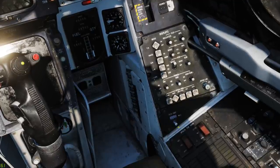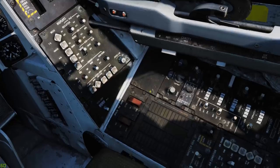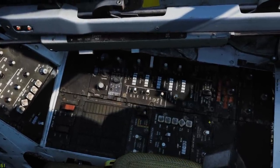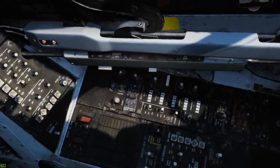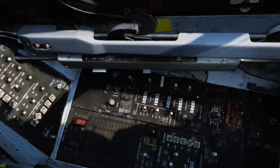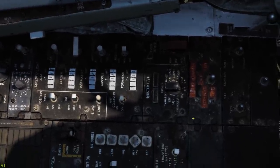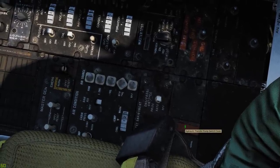Hiding just beneath that we've got our elevation for our gun. Coming down the right-hand console we've got our spoiler override — if we get any damage or lose some spoilers we can override the functions. Caution light panel — quite a big one, lots to go wrong. Generator panel, air panel for your air sources and internal air conditioning, external environments for anti-ice on engine and probe as well as the windshield. Down the outer wall: compass panel, ILS panel, lighting panel for internal, external and taxi lights. Master test switch, needed during some startup procedures. Emergency flight hydraulics switch under this cover. And hiding down in this corner is the hydraulic transfer switch — you'll need that during startup.